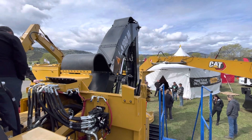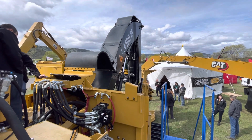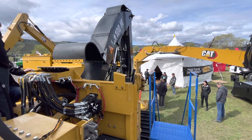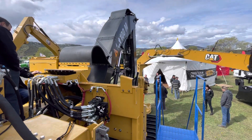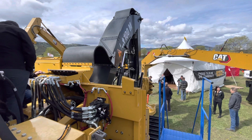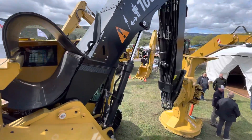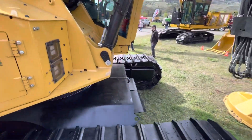This is an entirely new boom — this is not a Cat boom. I'm guessing it's set up to have some sort of ER-type system on it. Looking at the pumps, it's closed loop swing, closed loop drive, pretty much closed loop everything. I think they said a total of eight pumps, so I think this thing is going to be a bit of a multifunction animal. Be kind of curious to get some operator feedback.